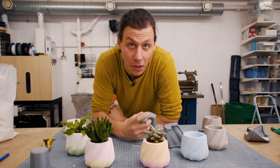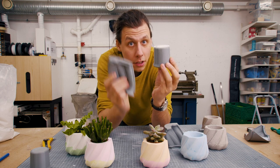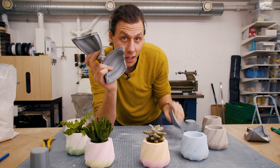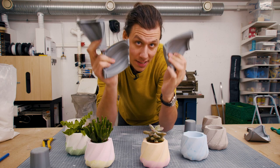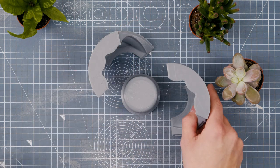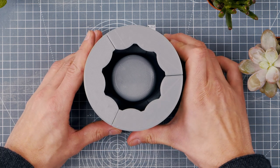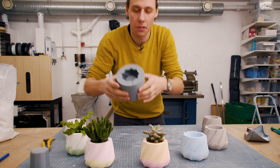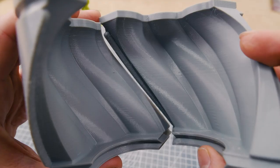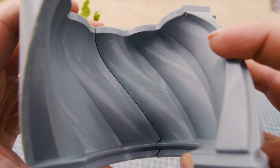The really cool part I'm proud of is that this entire mold consists of only two parts — just these two. You'll need one center piece, and then this other part you'll need three times — they're exactly the same. The three outer pieces align against each other around the center piece, and since all the parts have features along the edges, they automatically make a fairly tight seal so you don't need to worry about any leaks.